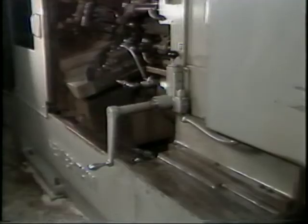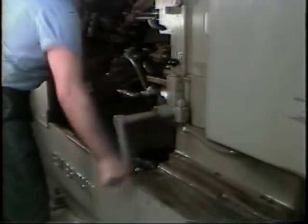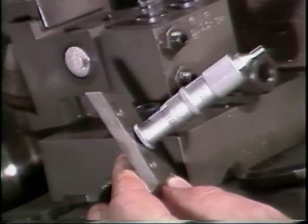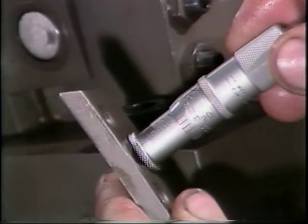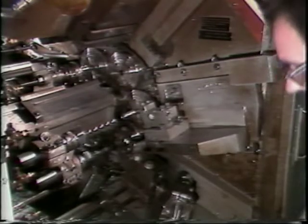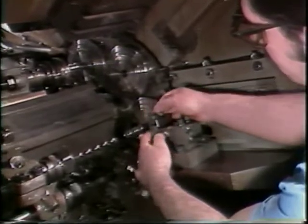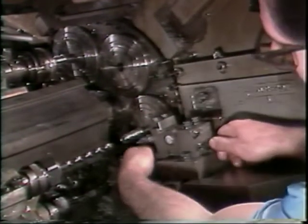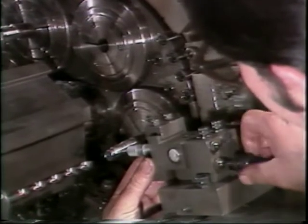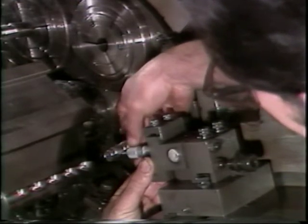Remove the thread rolling head and adjust the feed adjusting screw to bring the thread roller adapter all the way back from the piece. Hand crank the machine to the high point of the thread roll cam. Next, set the micrometer positioning gauge to match the number on the rolls — in this case, four hundred and forty-nine thousandths. Insert the gauge into the adapter and tighten the holding screws. Adjust for proper feed by advancing the feed adjustment screw to cause the gauge to contact the center line of the blank. Dial in the gauge to remove it.